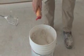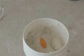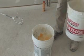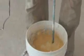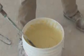Mixing in the Never Miss coloring gel is easy. For larger batches, add about 1 ounce to a 5 gallon bucket of compound. Add water to thin compound as desired. Never Miss has been tested and approved by major joint compound manufacturers and will not void warranties. Thoroughly mix in the coloring gel, which is available in both yellow and blue.